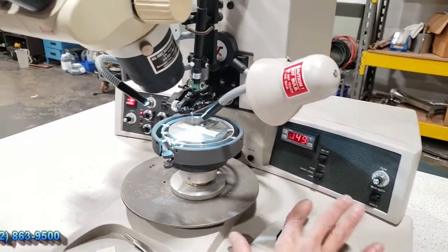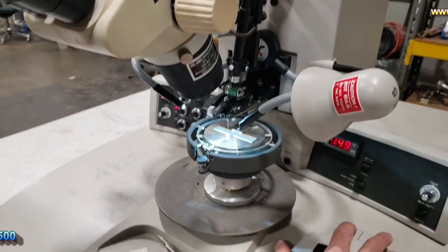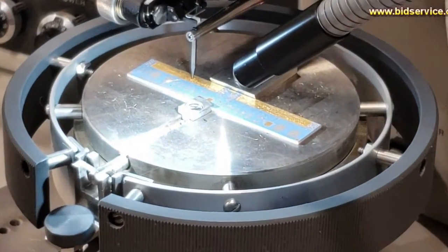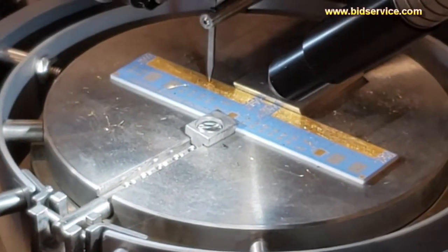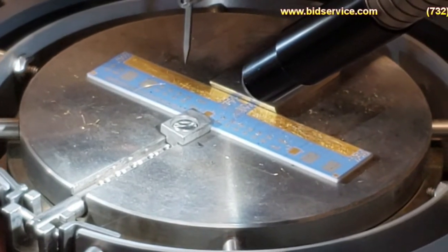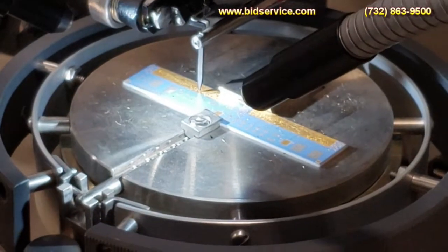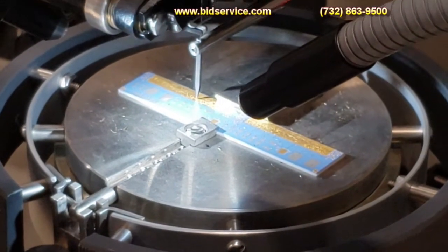Using the Chessman, press and hold the left side button — that'll bring you to your search height. As you can see, the bond head has stopped. When I release it, it'll continue down to make the bond. It's up to loop. Step back and go ahead and make search two and bond two. You can see the head is moving; it'll create a tail at the end so you can start bond one again and step back to make bond two.